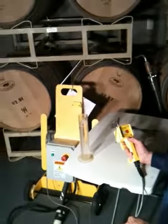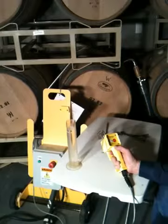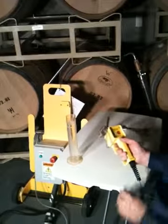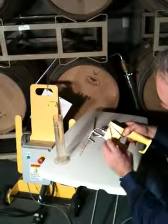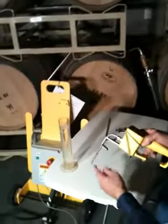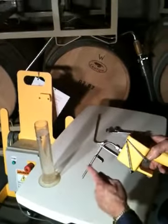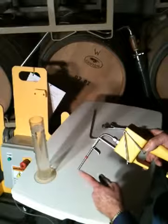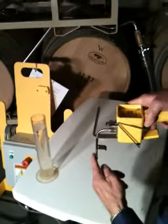This video is being produced to introduce the viewers to the calibration and leak testing of the SmartRack control system. This is using the handheld controller. This is a pressure sensing unit. The sensor is actually inside this handheld controller. This little red elastic band is used to demark, or to give you an indication of where you want the level to shut off. So we've got it set in approximately 2 inches from the tip, measured vertically up.